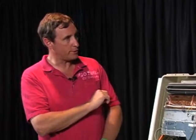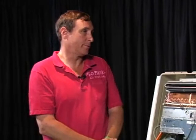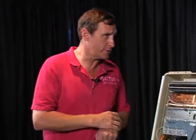What is our incoming water temperature? If he wants to, it's real simple to get a laser thermometer. Yeah, I mean, it's something I'm sure that they carry with them. Or they should. Measure the incoming water temperature. Typically, we want to see in Colorado an 80-degree rise. There are other parts of the country where you don't size for an 80-degree rise. Southern Florida, for example, the water's coming in at 75 degrees. If the water's coming in at 75 degrees, to get it to 120 is only a 40-degree or 45-degree rise.